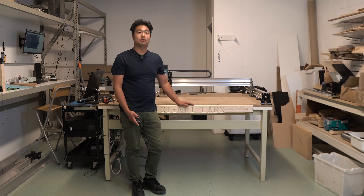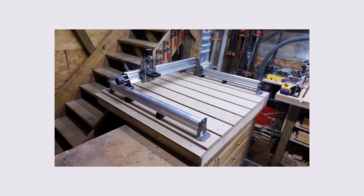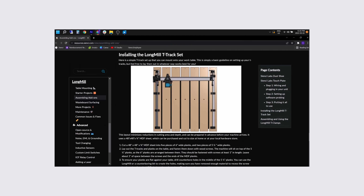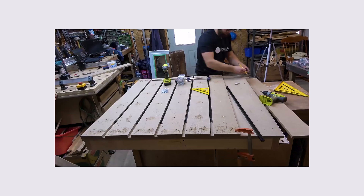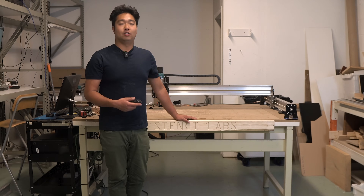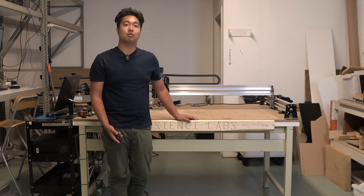The last thing you need to get for your CNC machine is a bench and spoil board. This is just a large surface that you can mount your machine on. It should be noted that the surface should be as flat and strong as possible, since any flex or irregularity may show up in your cuts. Some people make a bench from scratch, or they can use a sturdy desk or dining room table as well. You'll also need a spoil board or waste board, which acts as a consumable surface for your projects to sit on. We recommend ¾ inch MDF as it's cheap, readily available, and dimensionally stable. You should be able to buy a 4x8 sheet and cut it into 2-3 waste boards for about $60.